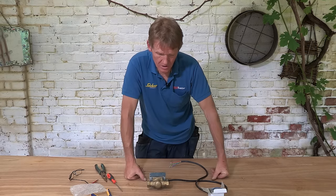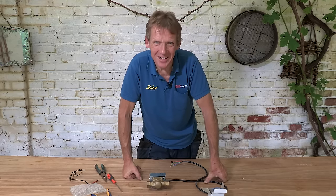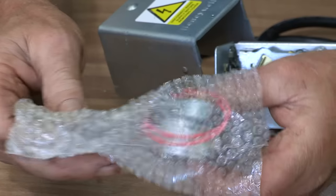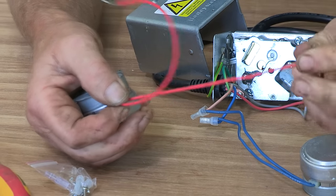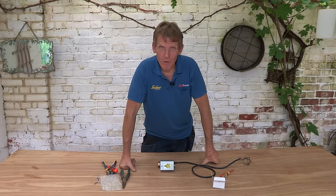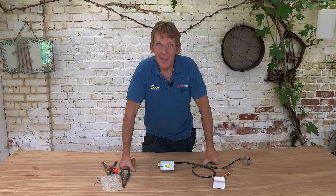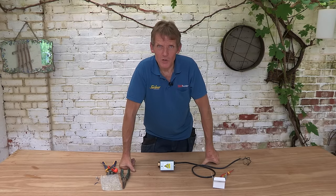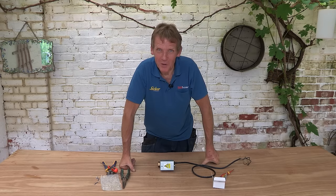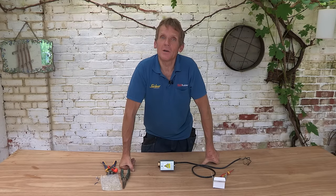It's an easy job - no rewiring, just those two wires to connect. Some plumbers replace the whole valve rather than just the synchron motor, which can mean draining the system and turning a simple job into a three-hour one. Knowing how to do this little job and picking up one of these synchron motors can save you sometimes hundreds of pounds. That's how to wire up a synchron motor on a motorized valve. A lot of electricians avoid central heating wiring and plumbers look for an electrician, so it's one of those jobs that falls between two camps. I'm Roger, thanks very much for watching - subscribe for more hints and tips from Skill Builder.